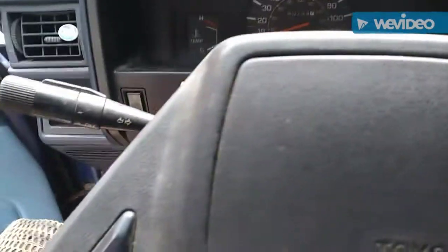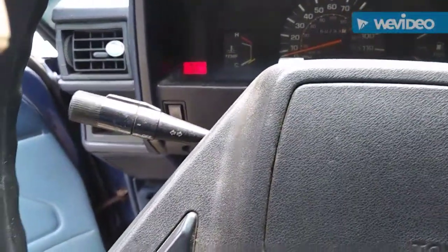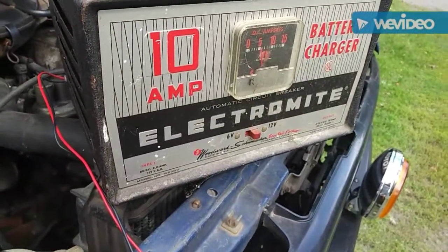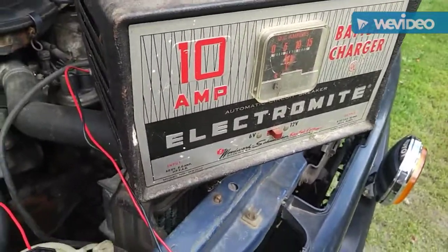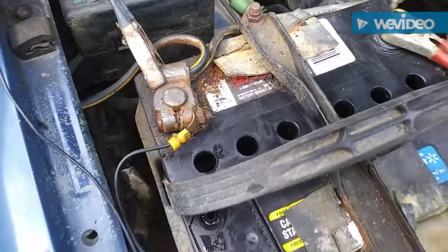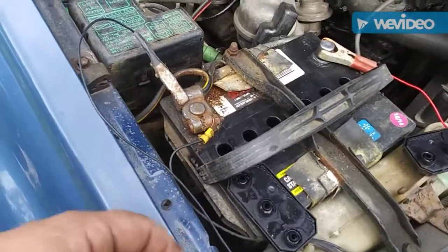Let's go see how she sounds. Dead battery! Must be the radio's on. I'll tell you guys this cold start, but my battery went dead. I put my old battery charger up to it and it's going down to zero. It looks like the first compartment was bubbling pretty good, but it seems a little low. I gave somebody a jump start and we had the cables reversed — I don't know if that helped the battery. Probably not. It might have killed it.